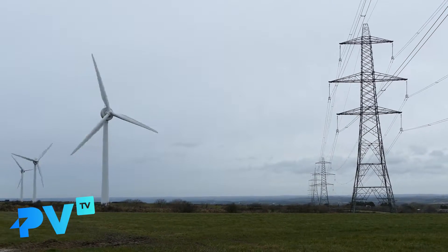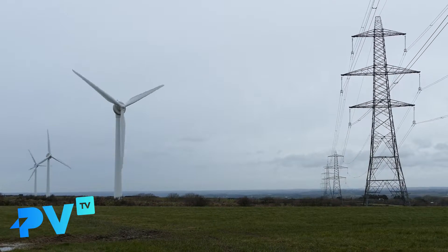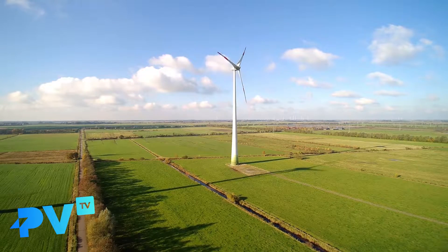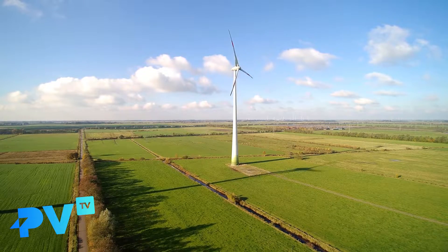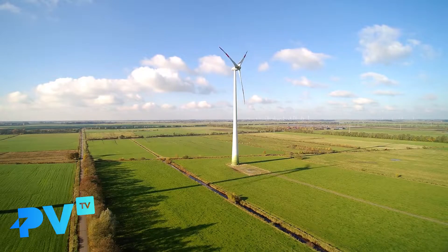The last thing we wanted to talk about when going off the grid is wind turbines. The topic of wind turbines and off-grid is very popular, mostly because a wind turbine can run 24 hours a day — it doesn't need the sun, it just needs wind. So for people in windy areas, this is a very enticing option. However, we don't install many wind turbines on off-grid solar systems. Here in Australia we work on 240 volts, and this whole conversation is based around a 240 volt AC off-grid system. When it comes to converting wind power to 240 volt AC, it's not very cost effective compared to lithium batteries and solar panels. For an effective wind turbine, including the pole and everything to get it fully set up, it's a much bigger investment than if you put the money into batteries and solar.